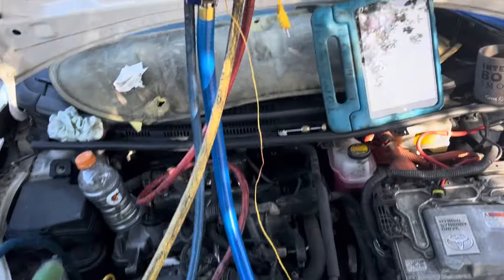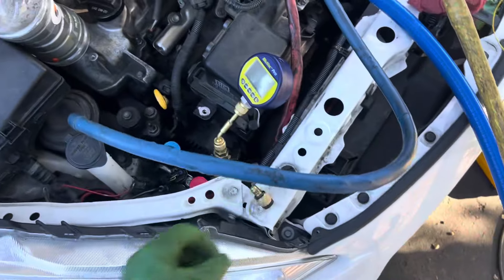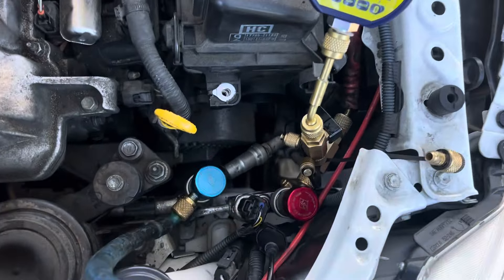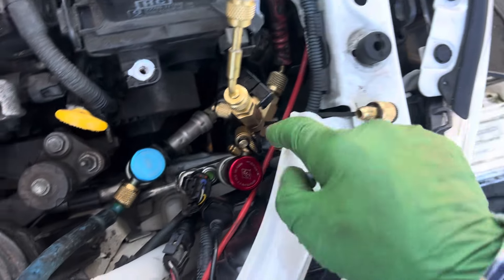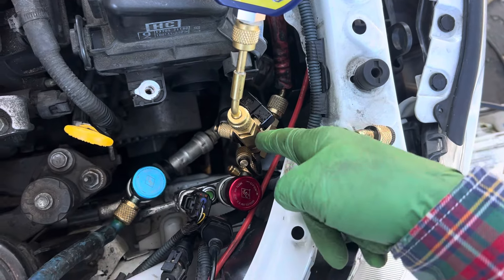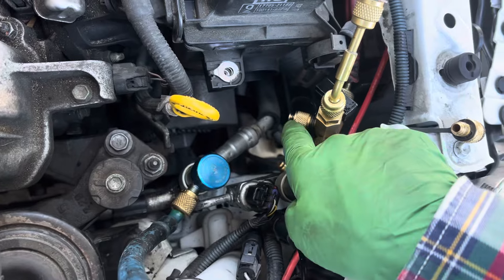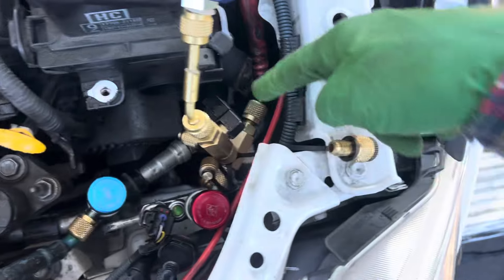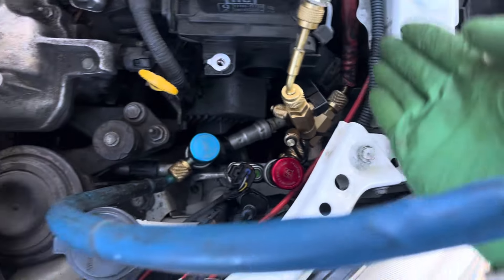After a recharge, I'm going to show you the charging setup for using the ball valves, where you'll use your micron gauge and you want to isolate it. Look down here — this is a more difficult one because of the placement, getting your hands down there. But as you can see, I have a core removal tool off of a T fitting on your side, so we have two identical core removal tools. You can see this ball valve right here — the handle is in the off position because I have refrigerant in there now.